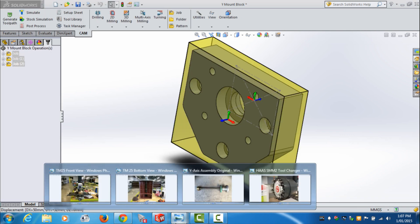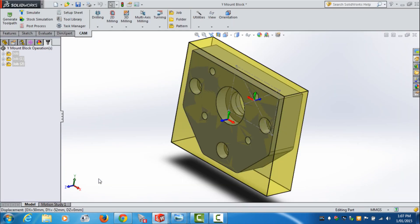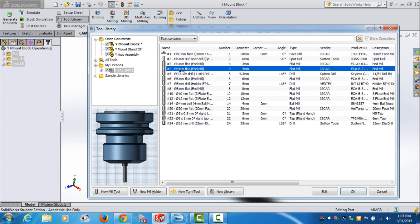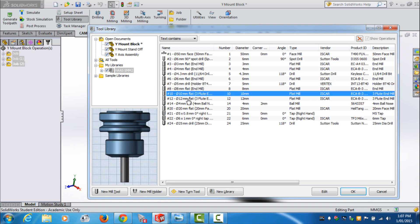A good thing with HSM — I'll show you here on the Haas Super Mini Mill — you can see I've got a fair few tools. The tool changer in the Haas is 24 plus 1 in the spindle. In HSM you can put all your tools in the database, in your library, so your machine can use them. I've created my own folder and got all my tools with all the different offsets — carbide, chip load, and all that sort of stuff. It just makes life so much easier.